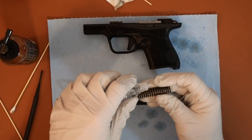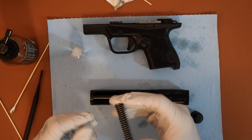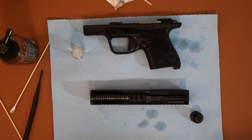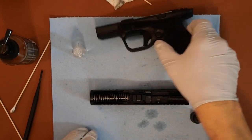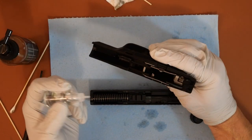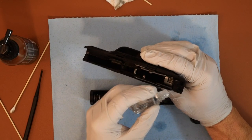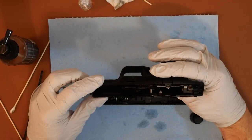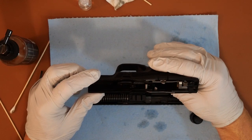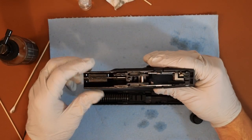Normally I would put a drop of oil on the recoil spring assembly and spin it around, but it already has enough on there so I'm going to go ahead and insert it and get that all lined up. Then on the frame I'm going to put a drop of oil on the rail there — front and back. Normally what I do is watch to see where I start seeing metal-to-metal wear, and that's where I would add another drop later as I'm cleaning — just where I start seeing some of the coating coming off and metal-to-metal wear, just for protection purposes.